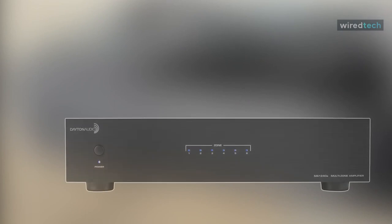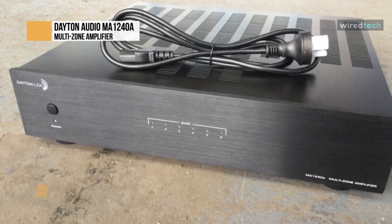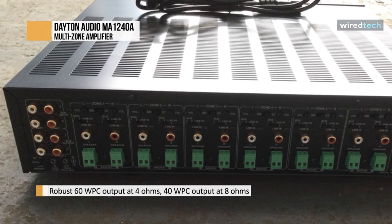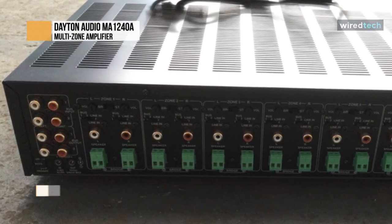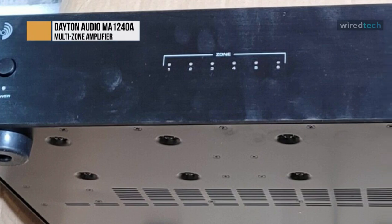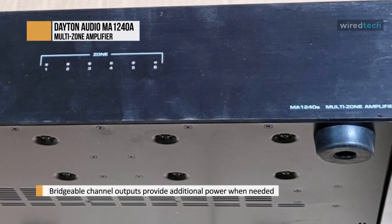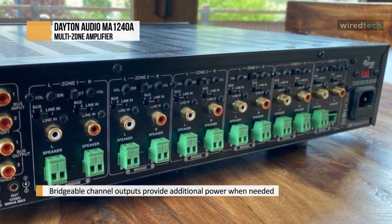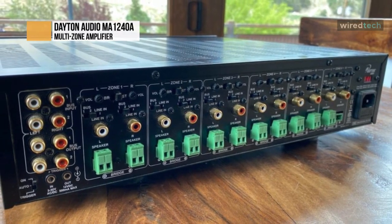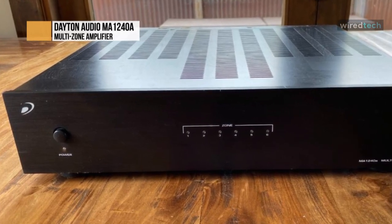Dayton Audio's MA-1240A freestanding 12-channel amplifier is designed for custom multi-room sound distribution. Its intelligently engineered and versatile design integrates easily into high-end whole-house audio systems. The MA-1240A features a Class AB output circuit that delivers superior audiophile sound quality and stable performance. Each of your installation zones can benefit from the MA-1240A's clean audio reproduction and exceptional functionality. The MA-1240A can be stacked with other audio components and includes movable ears for mounting in standard audio racks. Two common bus inputs feed audio signals from standard line-level audio sources to any or all channels. Each of the 12 channels has its dedicated input and independent level adjustment. By simply flipping a single switch, two channels can be bridged to increase the total power output for that zone.